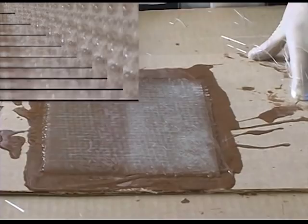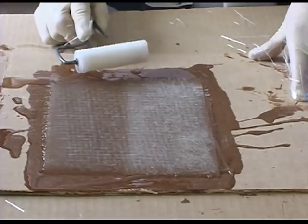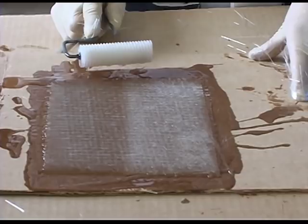What we're doing here now is we're just using one of our plastic rollers on that laminate we just had, and we're going to finish it off with one of the inexpensive plastic laminate rollers. You don't need a professional tool, just as long as you've got a good rigid roller, and we're going to clean the rest of that laminate up. Go ahead, Bernie.